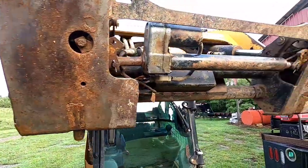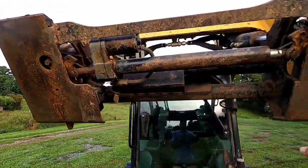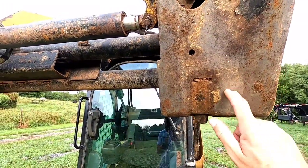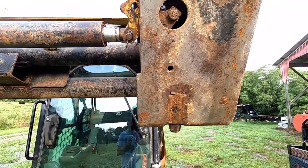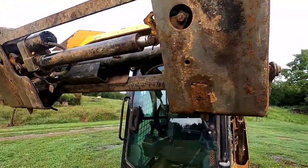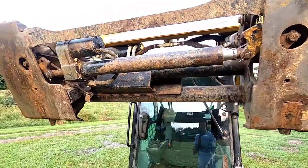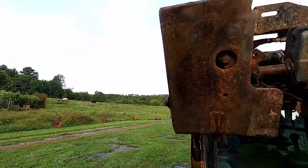And there's the problem — with it fully engaged, these ears are nowhere near enough up inside this part in order to release a piece of equipment. In order for that to go up, those have to go way up inside there, but the machine's blocked. I'll shut the machine off, take this part off and show you it in its full length outside of the machine, and then show you what I've been doing to get a piece of equipment off and on this machine.